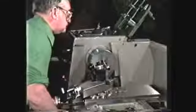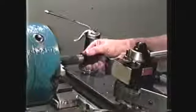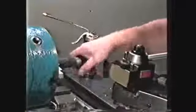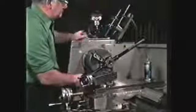This videotape will demonstrate how to machine or chase tapered pipe threads. A tapered pipe thread permits a tighter connection than would be possible with a straight thread. As with other thread forms, tapered pipe threads have a standardized system, the American Standard Taper Pipe Thread Series. For a rougher thread finish, the tapered pipe thread can be chased with a die. For a finer thread finish, the thread should be machined on the lathe.